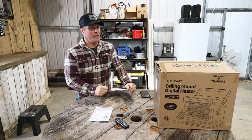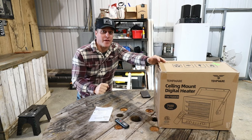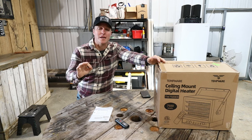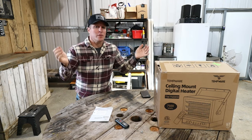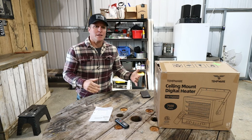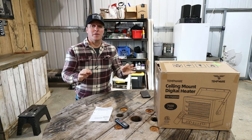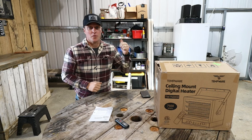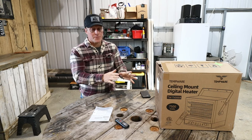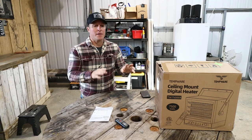That sums up another project and an install and review of this Tempware 7,500 watt heater. Remember, heating your shop or garage is a lot about the insulation factor. In this metal structure that's 26 by 40, the insulation is rated poor — there's no insulation in the eaves, so there is some airflow. This heater would work perfectly in a completely sealed up two car garage, probably more than efficient. But for us it's a little bit lacking. Once I complete all the insulation and bring the R factor up, this will perform perfectly. I'll give this heater two thumbs up, but remember it is a budget entry level shop heater. There are much better, more expensive options. This one came in around $180, with about $50 in material to hook it all up — this is the budget way to go.